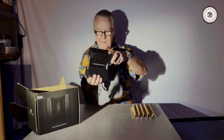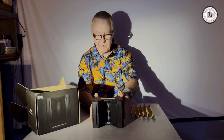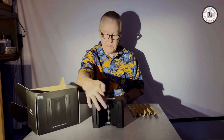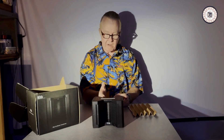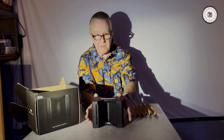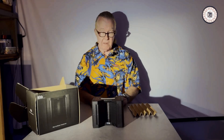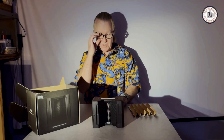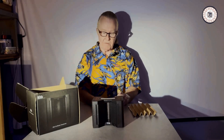This is very, very heavy. As I said before, it uses very powerful magnets to be able to squeeze the membrane. There is the diaphragm — as you can see, it's not colored tan like a Kapton membrane. It's a type of plastic or Mylar with little coils going through it. The magnets are ferrite. It's been used in quite a few speakers, going back to the 70s with the Heil Air Motion speakers, which I first heard in Germany — that was my first exposure to high-fidelity sound systems.